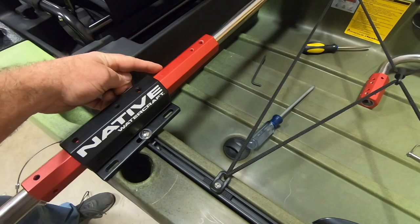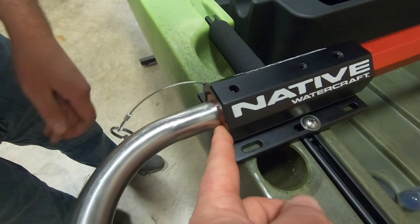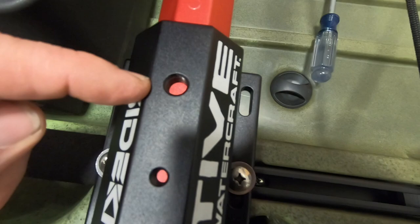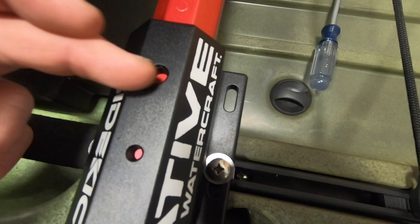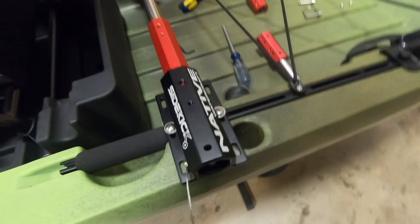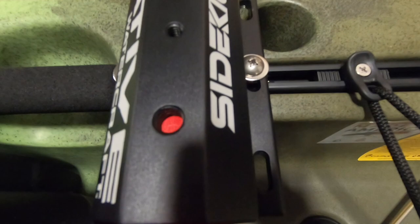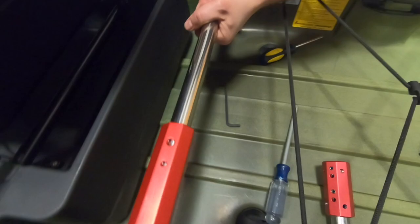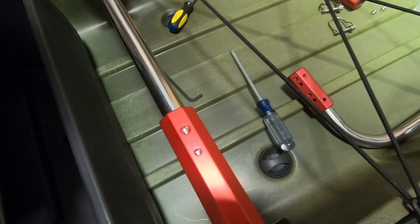The way you'll know if the insert is in far enough is that the leg itself needs to insert all the way into the receiver — so it's nice and flush. That means the insert is far enough that way, and then you need to make sure the insert comes in to where the set screw will go. As long as it gets well past the insert point, that's where we're going to lock the insert into place. Center them up so you've got equal distances on either side, then insert the leg and make sure it goes all the way in. We've got plenty of insert depth to put the set screw in and lock it into place.